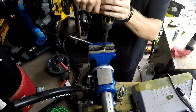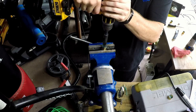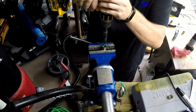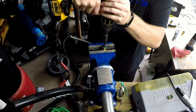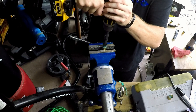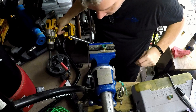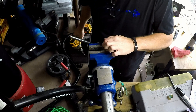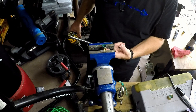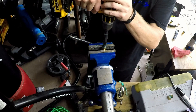See, that takes out big ol' chunks. Now I want to get down into the base metal just a little bit. If you go too hard, too far, too fast, then you will go through the bottom of the casing — you will blow right through the primer, which is not what we want to do.